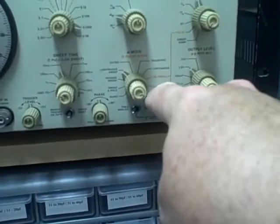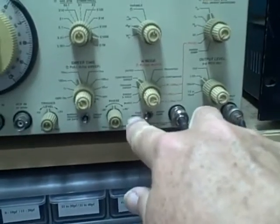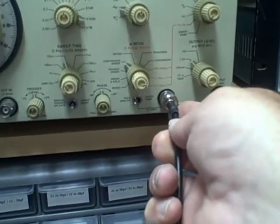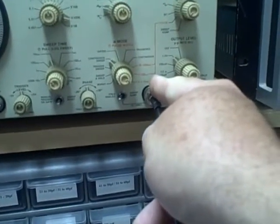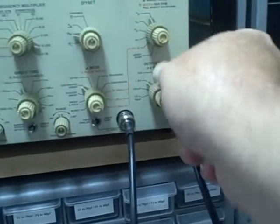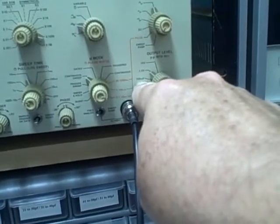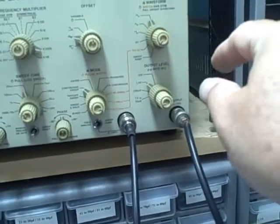And then you've got the ramp output that you can run. You've got analog frequency or sweep ramp coming out of this particular unit, this BNC connector here. That would allow you to give yourself the time base on an XY position, and this would be the output for the Y. You can go from 15 millivolts to 150 millivolts, 1.5 volts, or 15 volts.